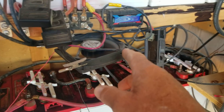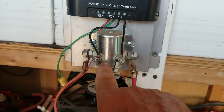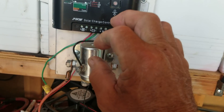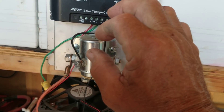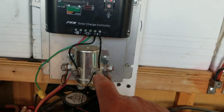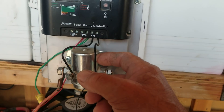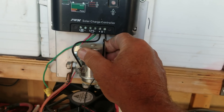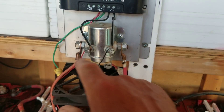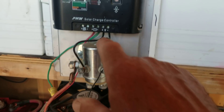This is an electromagnetic switch. When it kicks on, electricity is holding an electromagnet in contact with another magnet so they are locked together and making a connection across the poles. When that happens, this thing generates heat and it does get pretty hot. It's not hot now because it hasn't been running, but it does get pretty hot, so I have a fan down here tied into the same terminals — positive and negative — on the load side.